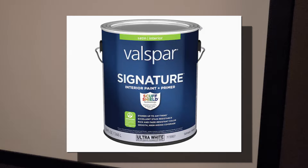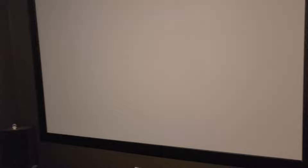I did multiple coats of this paint. You can still see some texture on the wall, but your eyes cannot detect that from the distance back — it's like 10 or 11 feet from the recliners to the screen. I put probably four coats; the wall was a lighter color before so it took three or four coats of home cinema screen paint. If you want to do this the right way, you're going to get drywall mud, re-mud the whole wall, and sand it until it's really 100% smooth with no bumps.